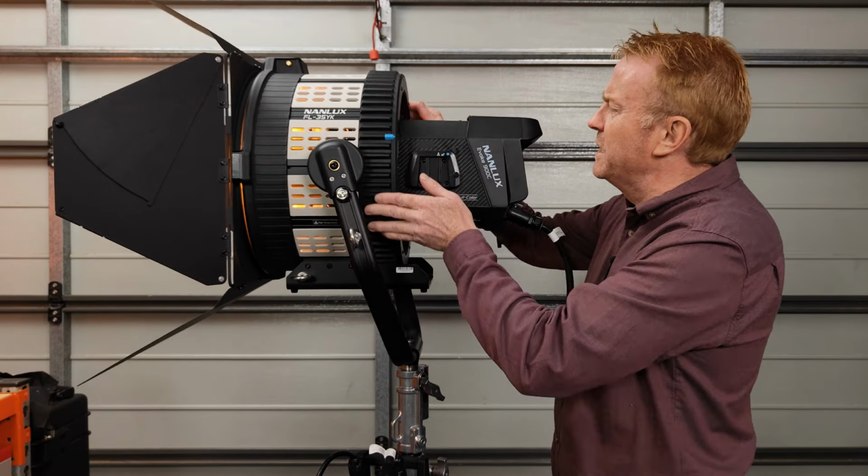Okay, let's start going through the user interface. In the top corner here, you have the mode that you're currently in. On the opposite side, it displays what your fan settings are. And in the bar down the bottom, it tells you what is turned on and turned off. Currently, I have my Bluetooth turned on, I have my Wi-Fi turned on, my CRMX is turned off, this is my selected DMX channel, and the keypad is currently unlocked.